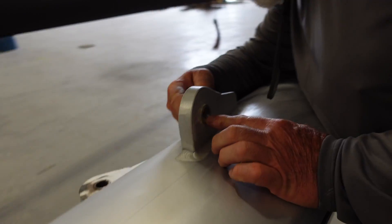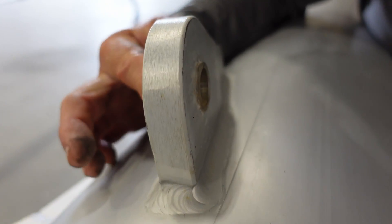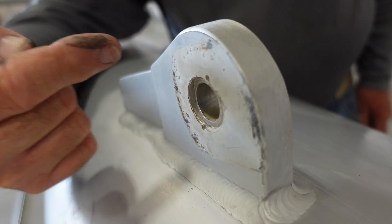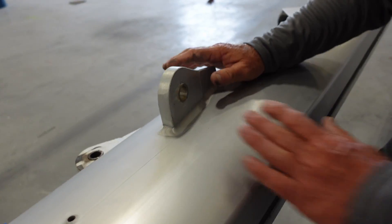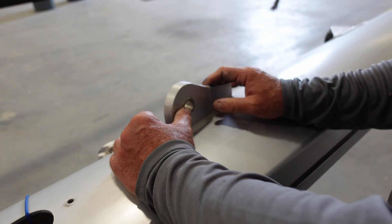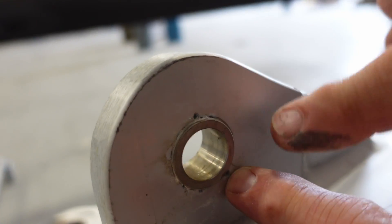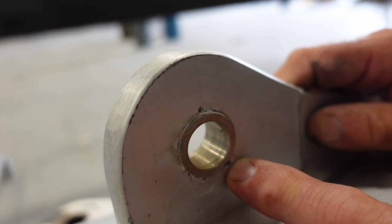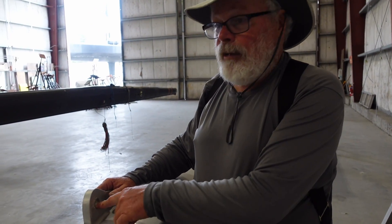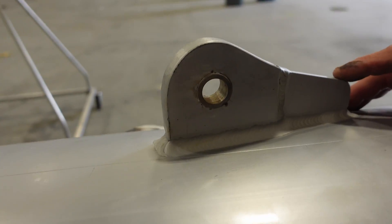You can see this toggle — how it's bowed out on this side and indented on the other. There's a little gap right through here where it's been pushed over. I think I can probably take a flat bar and move it back. These little punch marks here are what they did to hold the bushing in place during manufacturing — kind of an archaic way, but it didn't really work because it moved. It didn't fall out, it moved. They tried, but it was not a perfect solution.